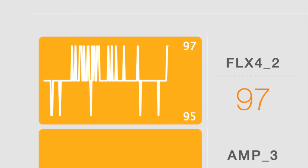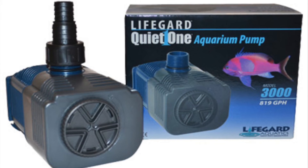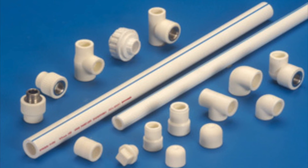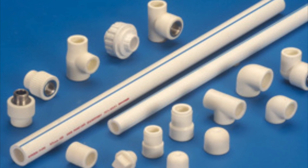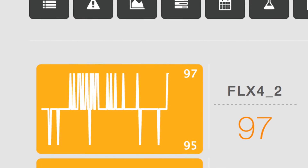Note: when you're looking at your flow sensor graph in Fusion and you think your pump was supposed to pump a certain number of gallons per hour but the flow graph is showing something different, remember that the gallons-per-hour number a pump manufacturer provides does not take into consideration pipe fittings like 90-degree bends, 45-degree angles, or T's. All these things add up and cause reduction in flow, just like pipe length and vertical height create head pressure and turbulence that will reduce the flow reading. The key here is to look for trends.